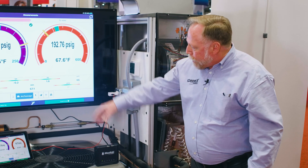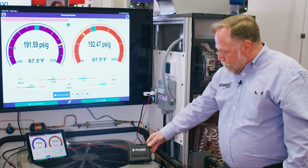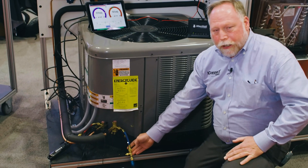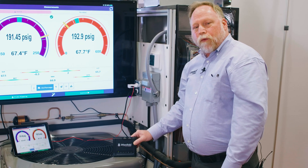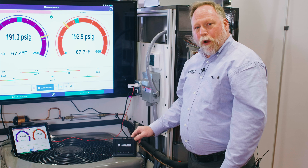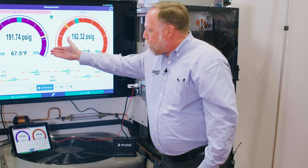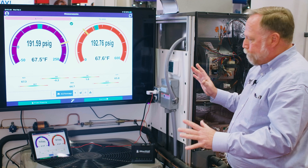We've got either an iPad, phone, or tablet for the display — this is the magic of what we're doing. This is our i-manifold, which receives signals from both our pressure transducer sensors and our temperature sensors. It uses Zigbee Wi-Fi with a thousand-foot range between the i-manifold and any of our sensors, then Bluetooth to any smart device. We're receiving all inputs wirelessly, then Bluetooth-ing to our iPad and displaying it on screen so 10-15 students can all see what's happening at one time.